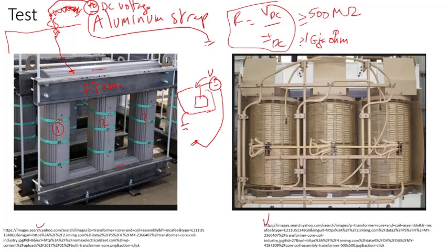For large transformers, some manufacturers or end users may also want the core frames isolated from the tank — since the assembly sits on the tank bottom, the frames should be insulated from the grounded tank. Bringing the frames out through a bushing allows you to test the core frames and core clamps during commissioning or routine maintenance, helping isolate whether the core or frames are unintentionally grounded.